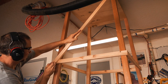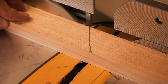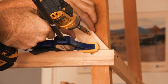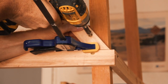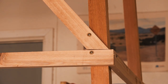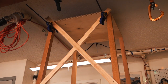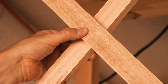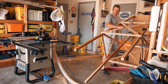For the cross braces I cut a miter at the bottom and top so they sit inside the horizontal braces. In hindsight this is probably not the best way of doing it — I should have cut them flush with the legs so they would sit a little more to the outside, but on the next one I'll know what to do. These cross braces are flexible enough that they can overlap each other and don't need any kind of lap joint.